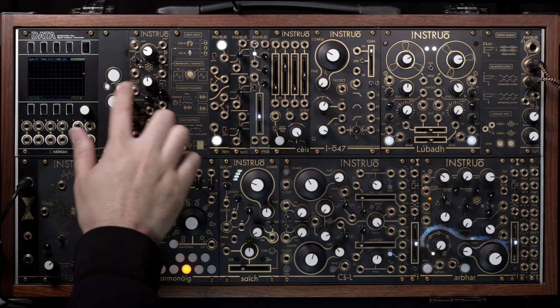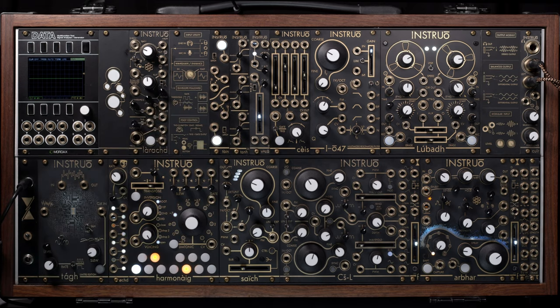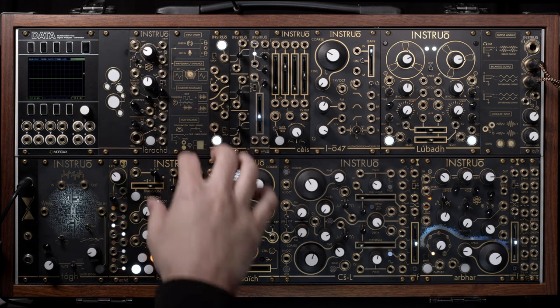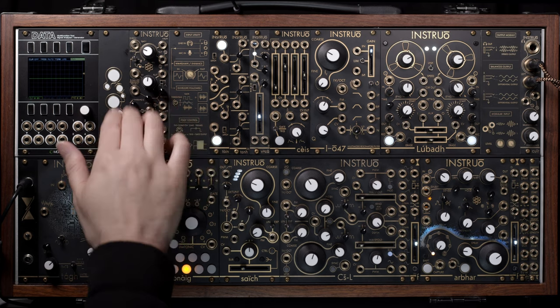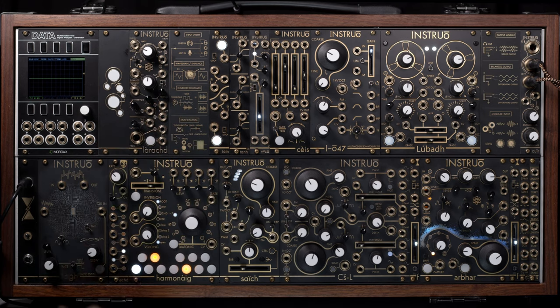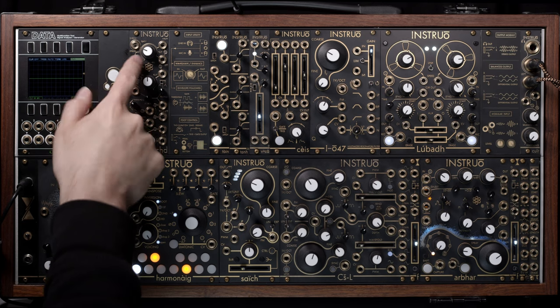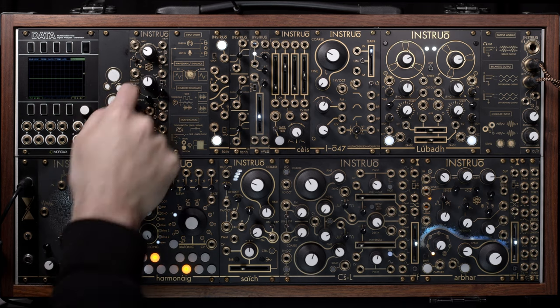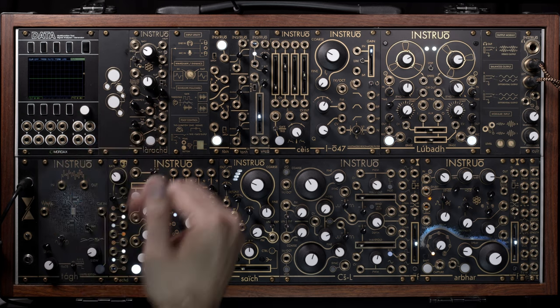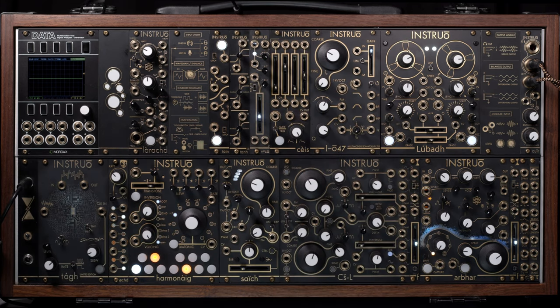This brings us down to our follower section — an envelope follower, or more accurately an amplitude follower or voltage follower. Before getting into patch examples, let me touch on the nuts and bolts of what's actually happening in this signal processor. The signal seen at the input first hits a full wave rectifier, which takes anything below zero volts, inverts it, and folds it positive.